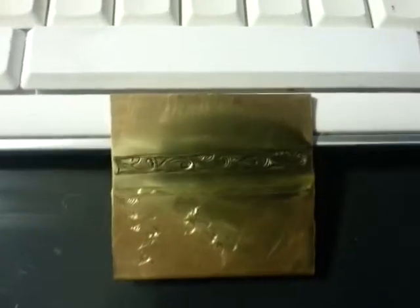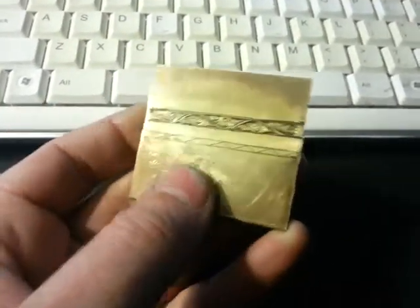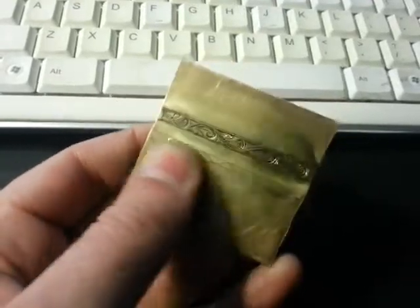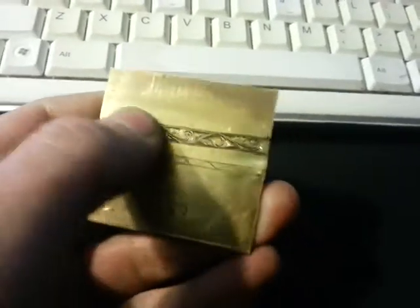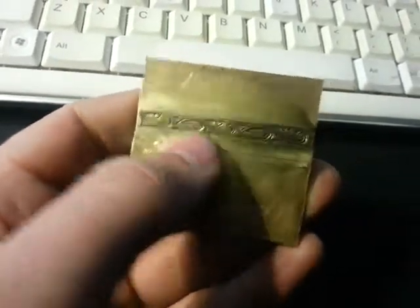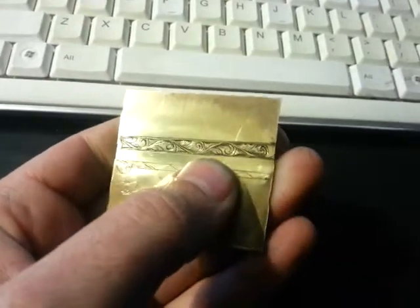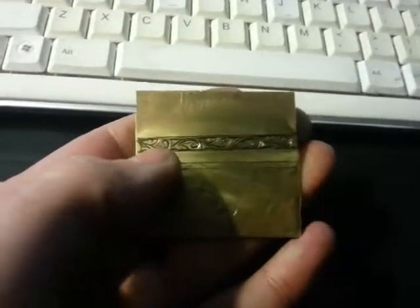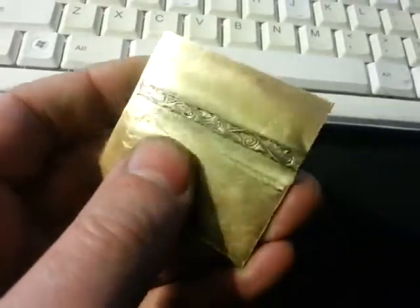I had to try a little bit of the scroll stuff, and you can tell all my other engraving has been light, so this is the first one that I've dug in. I lined it first, this sort of lining, and then I went in with the graver again afterwards, and sort of a deep, deep cut in it, to get a more sculpted sort of effect from it.